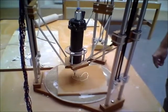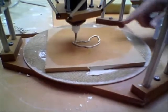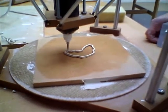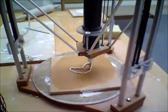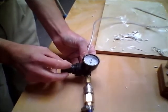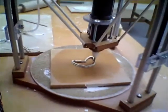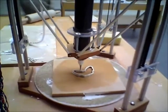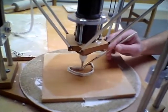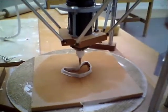It's a good idea to keep your first layer a little on the thick side, just so that it either has a strong base if it doesn't have a clay base, or that your first layers of clay will stick to a clay base if you have one. The rate of flow is then controlled over here — anti-clockwise is less pressure, clockwise is more pressure. At the moment my flow is absolutely perfect so I'm not going to go either way. It is a good idea just to keep the nib clean the whole time — with a wet paintbrush I will wipe down and make sure that there's no clay gathering on the tip of the extruder.